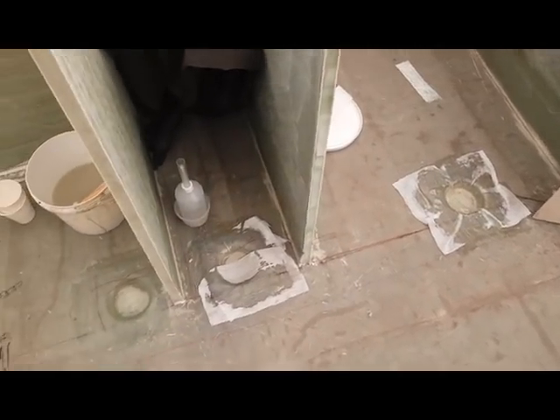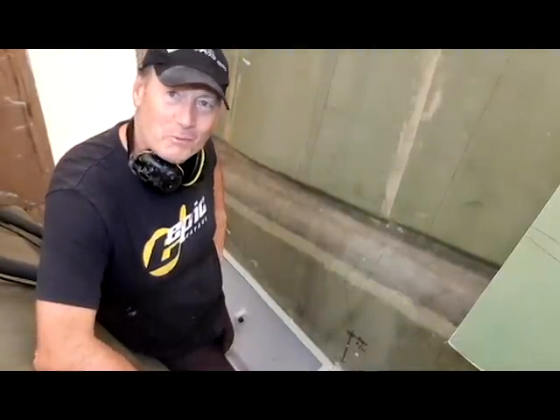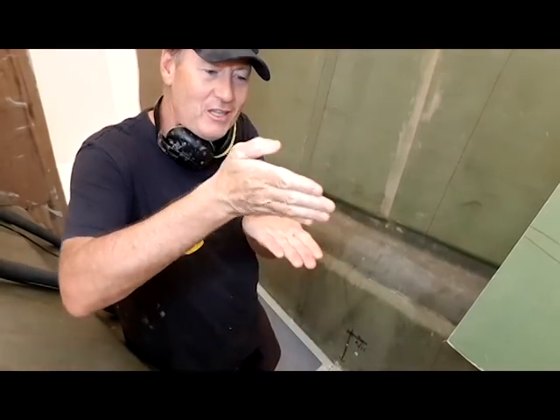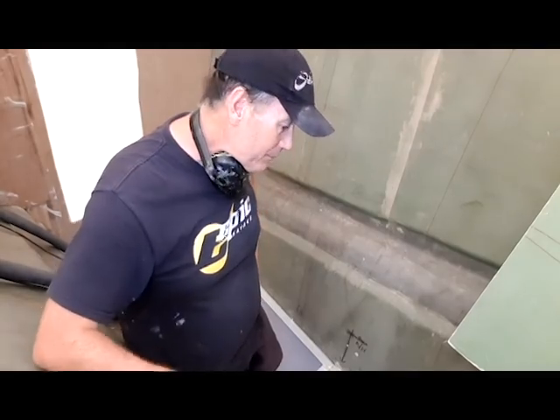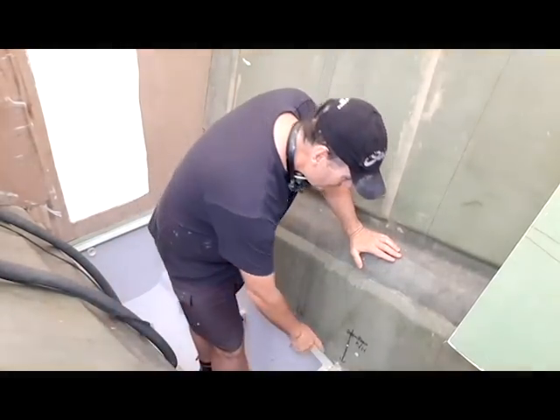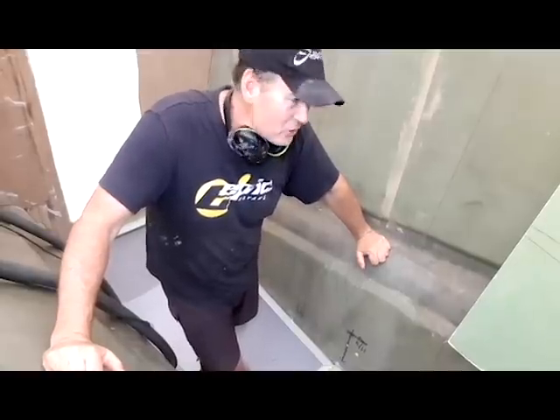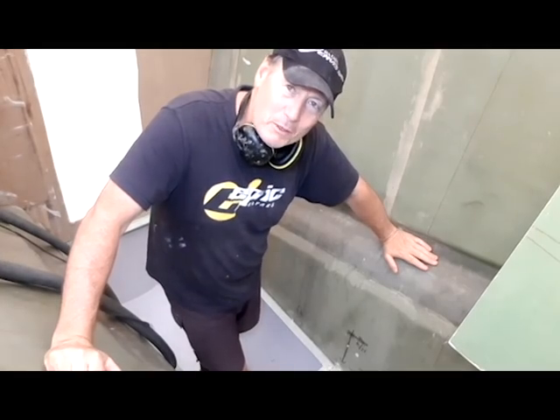They're all done. It's floor glue-down day and I'm pretty happy about that. I'm going to glue down the port forward cabin floor — this is a pretty critical component because the forward main compression bulkhead and the centre compression bulkhead actually sit on this particular piece of sole. There's plenty of structure underneath it, but it's going to be glassed to this floor, making it both a structural component and a major milestone that lets me move further forward with the project.